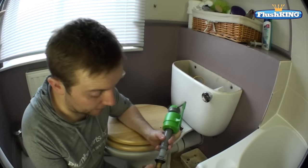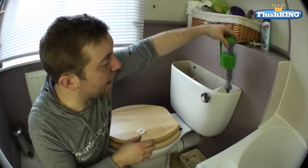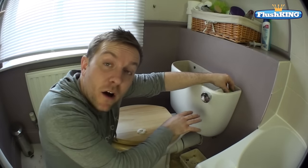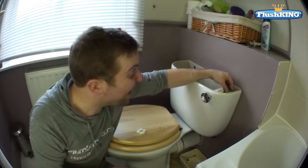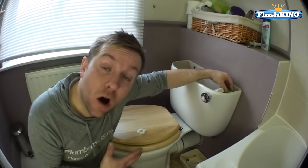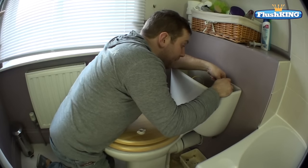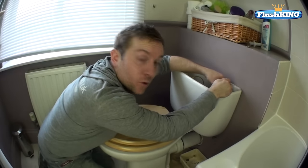What I usually do is undo the nut off the bottom and then pop the valve in before fully tightening it up. The reason I do this is so I can see what kind of height I want, see where the valve's going to stop and what the water level's going to be, and then whip it out again and adjust it to the height I'd like. These are such easy fill valves to adjust it's no real trouble at all.